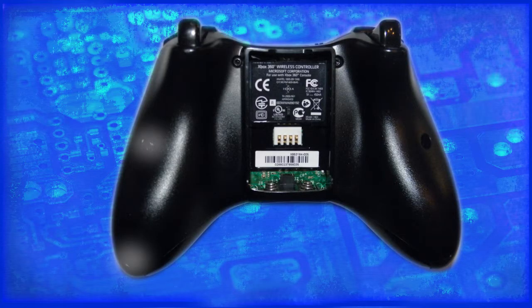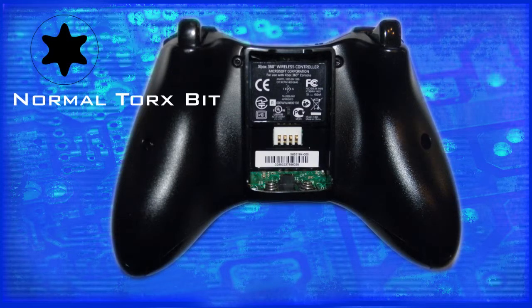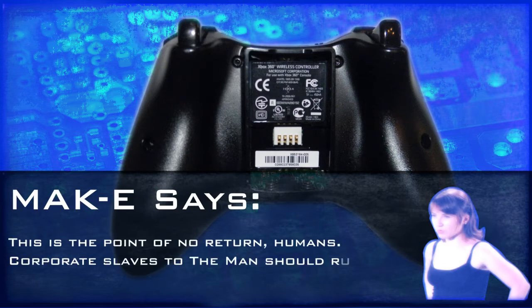On the back you'll find seven screws. The final one is located underneath the serial number sticker in the battery compartment. Using a number eight Torx bit you want to access these screws. However, they are security ridden — there's a little nub inside. Take a jeweler's flat head screwdriver, jam it in there ever so gingerly, and pop her out. You'll then be able to use your bit to access the screws.